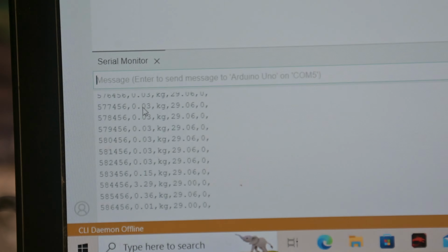And I'm going to play around in the future with this thing, maybe changing the length of the bell crank or something like that to try to get a little more leverage off of the bell crank to the servo arm. That might be a future project, but this was kind of a revealing project as far as what kind of loads the servos deal with and what kind of loads they can produce.